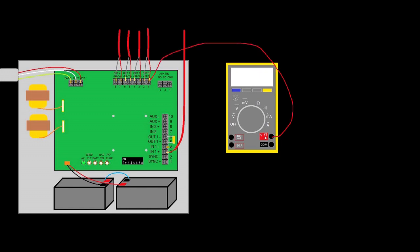We're going to set our meter to DC voltage and put one terminal on one side, one on the other. What I would expect to see — going off memory, it's been a while since I've worked on this type of power supply — a complete circuit would be about negative 1.5. The reason it's negative is because all of the markings on these are shown in an alarm state. So I think a complete circuit, when it sees the 4.7K resistor on the terminals, is about 1.5. And when it goes into trouble, I think it's about 3.0.